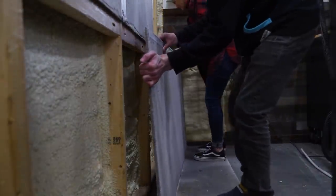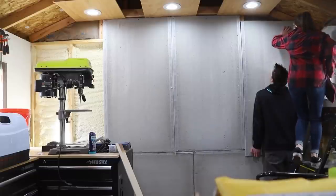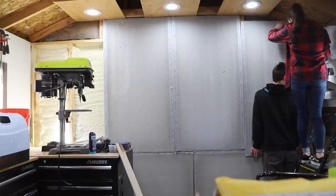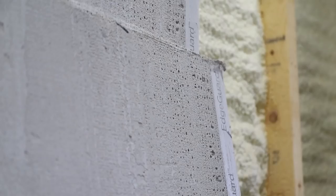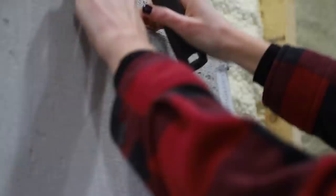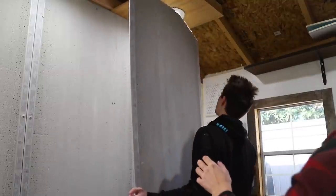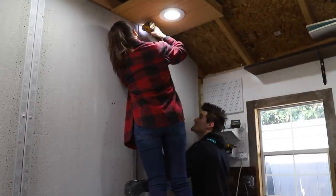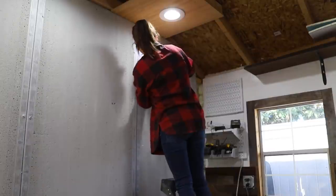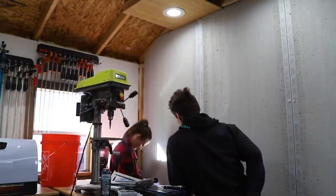To further my point — in the words of my brother, this stuff was awesome because it scores easy. I was able to use a cement board knife to trim the pieces I needed, snap them off, and then screw the cement board into the studs with my brother's help because these things were heavy. You can find the full list of materials and tools on my website by clicking the link below. These boards come in quarter-inch and half-inch thickness — I went with half-inch because I wanted it to be super rigid. Probably overkill for a cement accent wall, but I'd rather be safe than sorry.